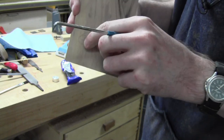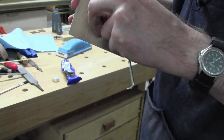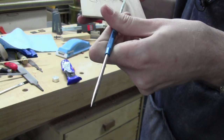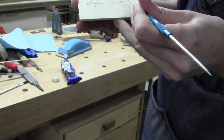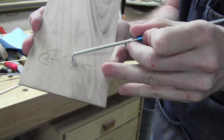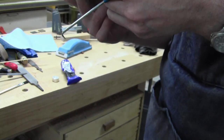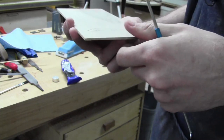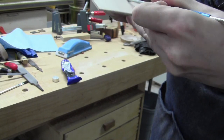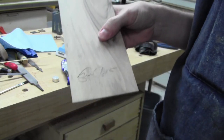That's pretty promising. What I'm gathering is I probably didn't get enough glue down inside the V-carving, because this shouldn't pull out so easily. We're going to play around a little more and run some more tests. I'm very encouraged — you can see right here how it's a varying color depth, that's exactly what I was after. It's going to be that perloid sort of look when it's polished. While it did not succeed 100% right off the bat, I will still call this a successful test because I gained some knowledge. We'll set up for another cut and see what I can do to improve things.